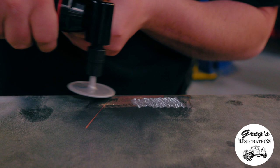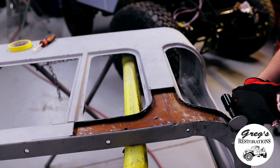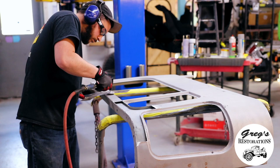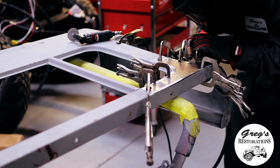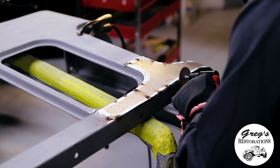One of the greatest features of this diamond wheel grinding disc is it doesn't wear out. We were working on this Land Cruiser project for about two days and it hadn't even worn out. Using our conventional discs that we normally use, it's ten to one — we'd be ripping through discs every five minutes. This one saves time by not swapping out discs. You're saving money for the customer and saving money in product. You can actually get into hard to reach places because the wheel is so rigid you can use it as a small cutoff wheel to remove material. It was very handy on the Land Cruiser because there were a lot of hard to reach places that a normal grinding disc couldn't reach.